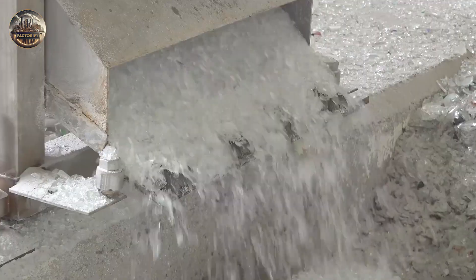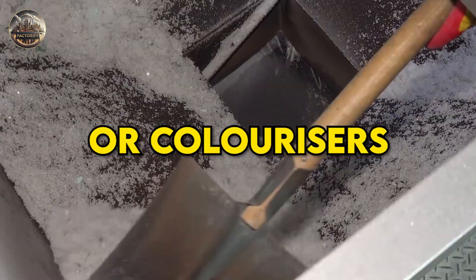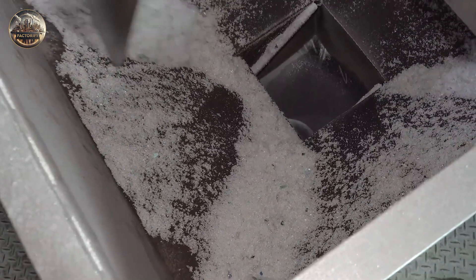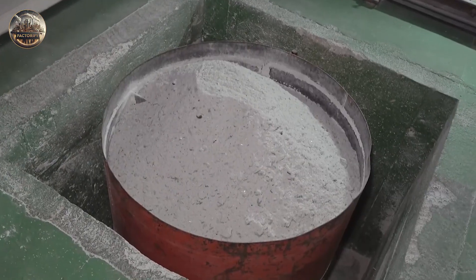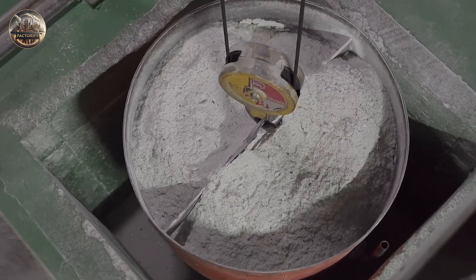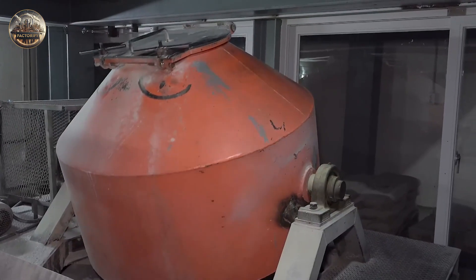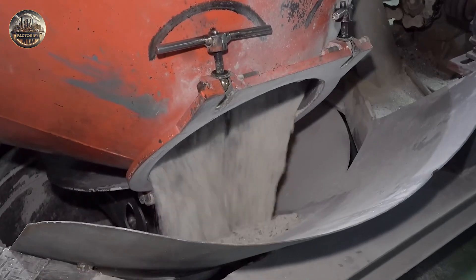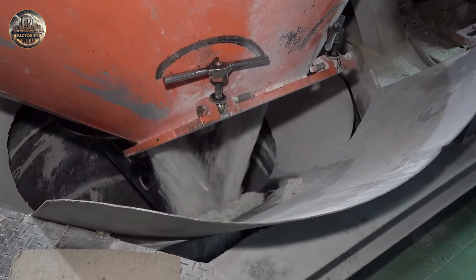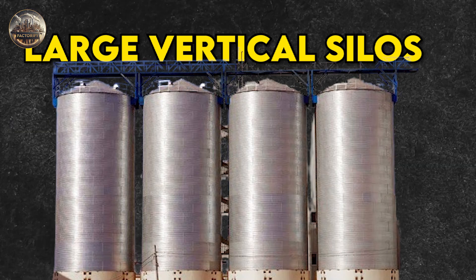The batch is prepared on a grinding machine. Raw material, cullet, and decolorizers or colorizers are ground finely in a grinder. The next step is to properly weigh these ingredients in the correct proportions before mixing them together. The mixing is usually done in a mixer until a homogeneous mixture known as a batch or frit is obtained. Before being fed to the kiln, the batches are stored in large vertical silos.